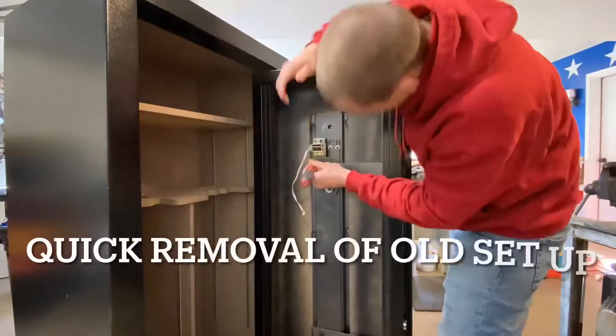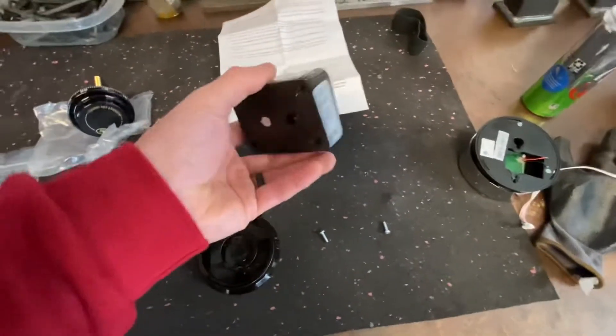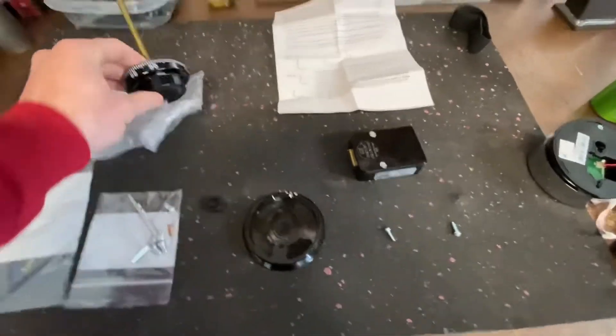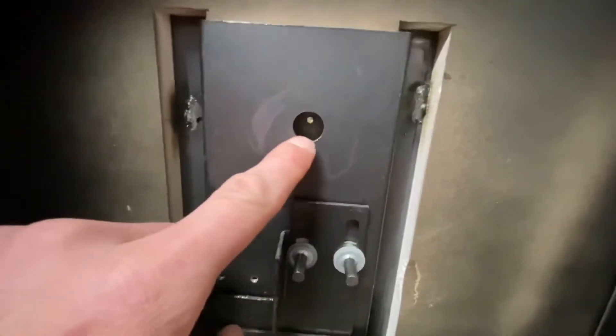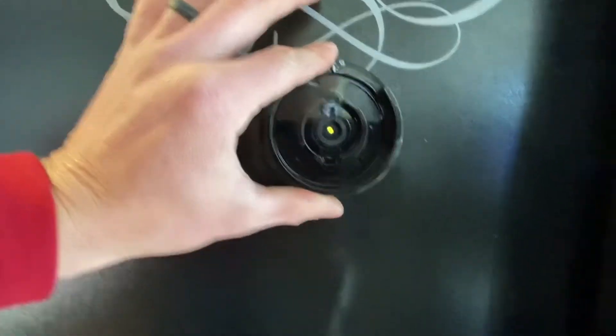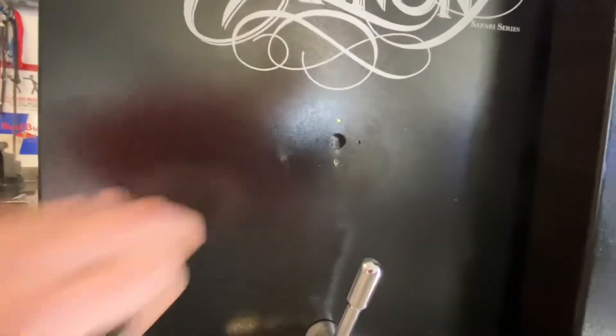The lock is opened up. This is the mechanism that gets mounted on the inside, and this is the backing plate with the privacy dial setup to hide some of the numbers. It looks like, in order to gain clearance, the mounting setup from the electronic lock is almost exactly where the mechanical one needs to go — like the factory may have set it up for either combo or digital. The gentleman told me the mounting screw for the digital setup will be my spindle hole in the middle, which is already spotted.